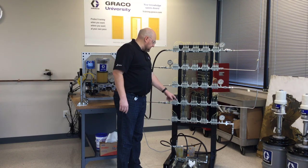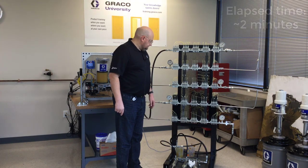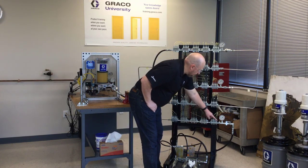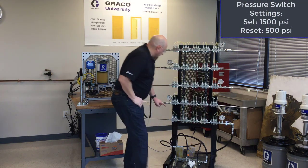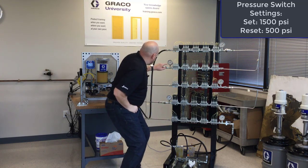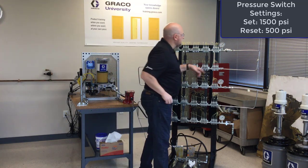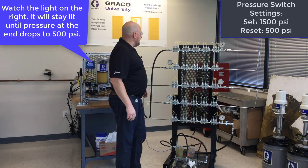This one just popped in so we only have one more in this row. It's been a couple more minutes and right here in this bank of four, the last couple are just finishing their reset. This gauge still shows 400 psi, this one about 350, this one about 250, this one still showing about 100 psi, and then this one isn't showing anything — though it may still have about 50 psi since the resolution on a 5,000 psi gauge isn't that precise.